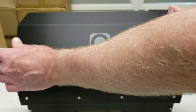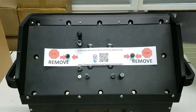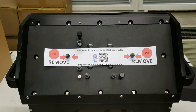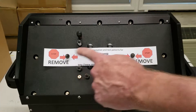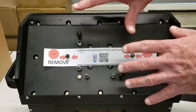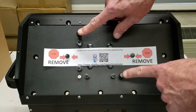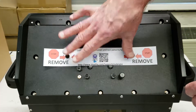When you first receive your Cinebrite, once the top cover is removed, you will find two black plastic lock screws in the back of the gimbal. These lock the two plates together for shipping to prevent damage. You cannot adjust the gimbal screws with these in place or you will damage it.